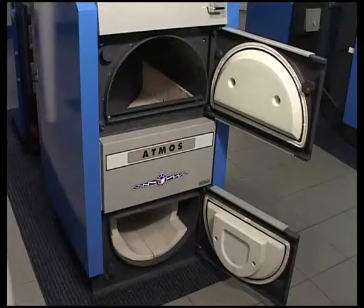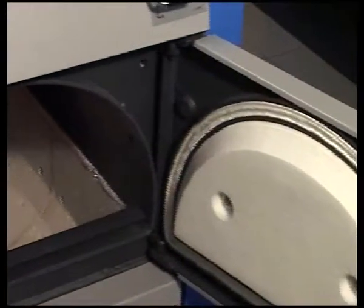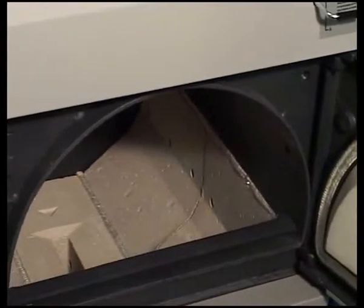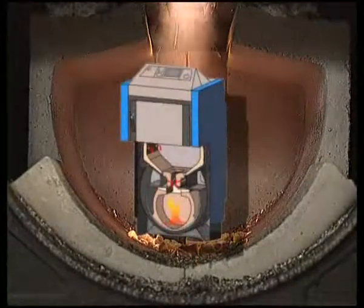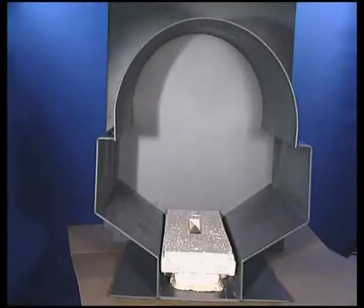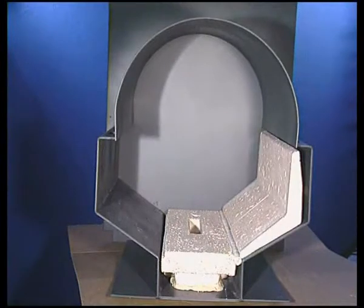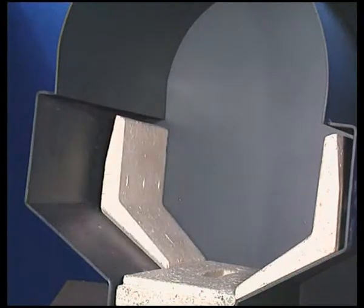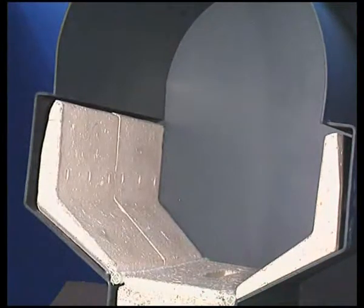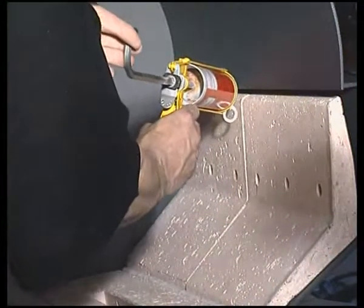On the Atmos Generator gasification boilers, the filling area has a ceramic insert with openings for the supply of primary air. During its replacement, we first align the nozzle, and then we insert one side that is comprised by two parts. Install the sealing cord. Insert the second side ceramic block the same way as the first one. Apply boiler sealant to the sealing cord groove in the top part of the boiler and tap the cord into the groove.